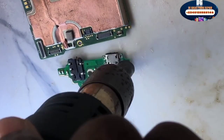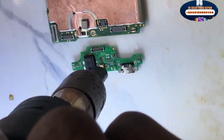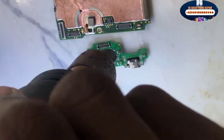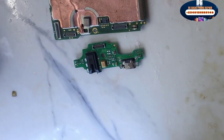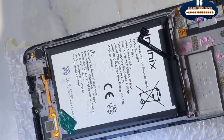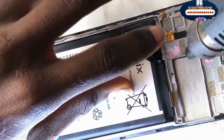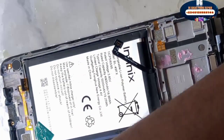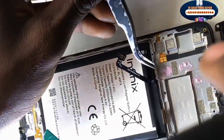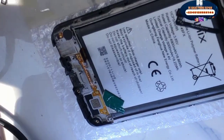Let your airflow be at maximum and the heat at minimum — the heat temperature should be at around 200 degrees Celsius. Once you have successfully heated the motherboard, also heat the clips — just heat them a little, don't heat them too much. Use your tweezers or picker to handle the components due to the heat.